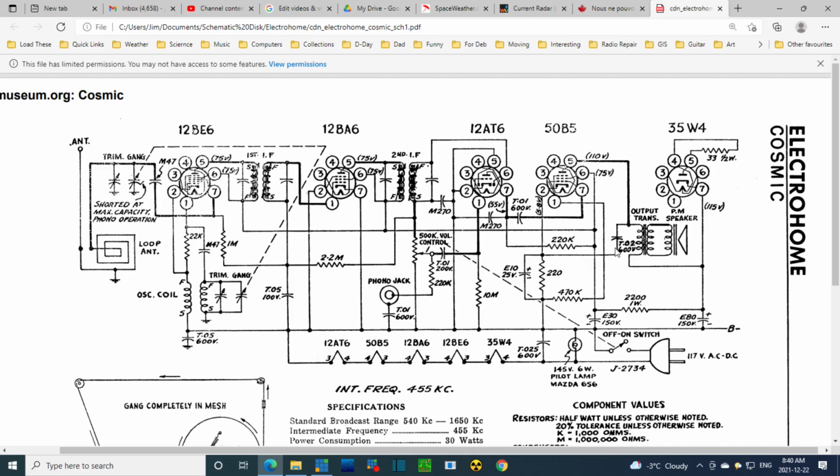If it's not working right, like for instance if its capacity is gone, I'm really not sure what the consequences are in terms of the sound coming out of the speaker if you don't have this capacitor. And if it's a very leaky one, because it is under pressure, it's got 100 volts on it, what would happen if you leaked back some positive voltage?